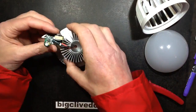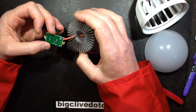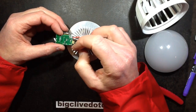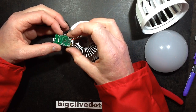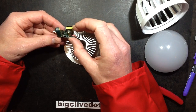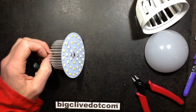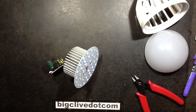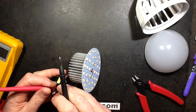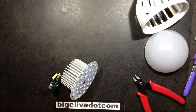It will be a typical switch mode driver chip. I see some characteristic things — actually, this might be one of the buck regulator type designs. I was expecting a couple of windings on the primary for that chip, but this transformer may not have that many connections, so it may actually just be a buck regulator. Let me check — it is referenced directly to the mains side. It's not isolated. So it is a buck regulator.